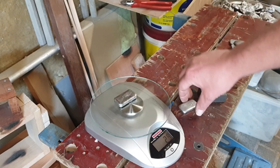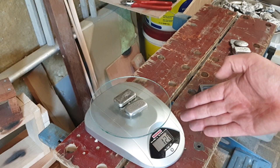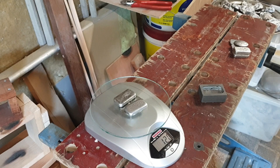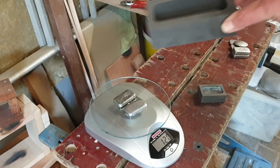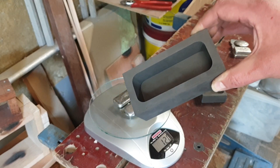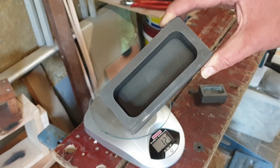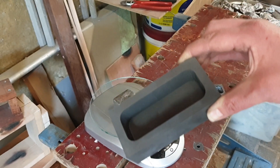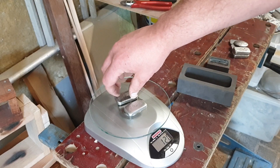I found two of these little ingots that together are 120 grams. If I need 12% tin, then I need 880 grams of copper, which would make 1 kilogram of bronze. I also have this nice bigger graphite mold which I've never used before. It should hold at least 1 kilogram of gold — gold has a higher density than other metals I use — but this should be enough for about a kilogram of bronze. So yeah, I need 880 grams of copper.